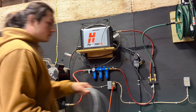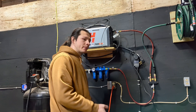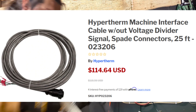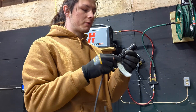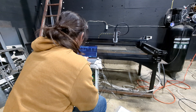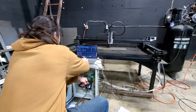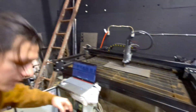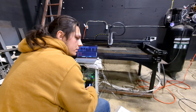First things first, I got to get this old cable coming out of the back of the Hypertherm. The Hypertherm's nice because it already has a voltage divider circuit in it — you just need to buy a $200 cable to access it. This new one doesn't have... I forgot what these blocks are — basically it's to stop EMI interference. After wiring in the Hypertherm CPC cable to the THC, I did a quick test, moving the machine around in X and Y to make sure everything was working properly. The Arduino's signal goes through the THC before reaching the drivers, so I wasn't even sure if the motors would still work if the THC was off. Because in the JD's Garage directions, it has nothing.